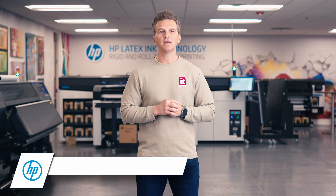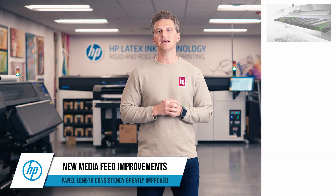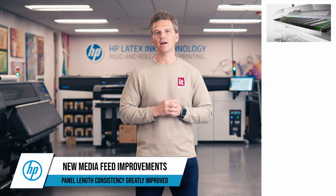An underrated factor in generating the best print quality in an inkjet printer is the feed assembly and the path that the media is traveling on. If you can't consistently move the paper, you can't print consistent colors. You can't print consistent lengths or details. HP has made this a point of focus with the new Latex 730 and 830. They've developed a new output platen that creates less media friction for smoother media travel.